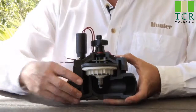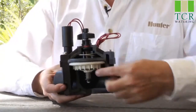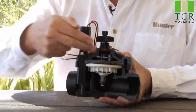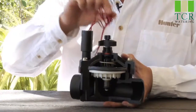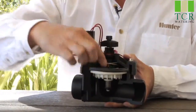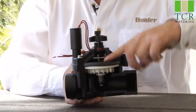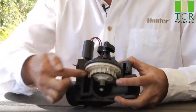The top portion of the valve has something called a bonnet chamber. At idle, the diaphragm sits down on the diaphragm seat. There's no escape of the water on top, so it's pressurized — the plunger is down, not allowing water to escape, so that pressure sits on top of the diaphragm. When the controller turns on the valve electrically, the plunger raises up, and the pressure and water sitting on top of the diaphragm is allowed to escape down the exhaust port and downstream. Once that water escapes, the pressure drops, allowing the diaphragm to move upwards off of its seat, allowing the water to escape downstream to the heads.